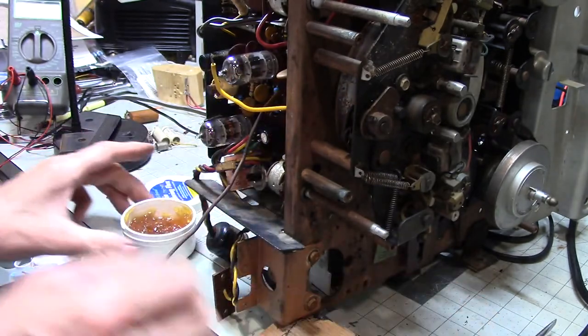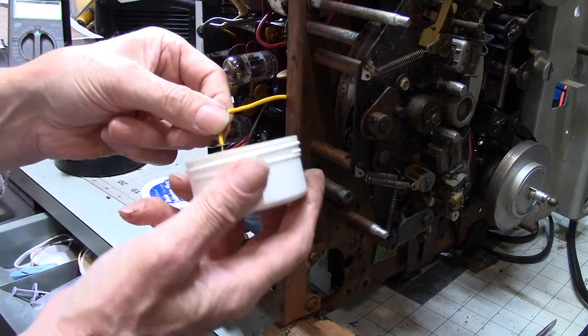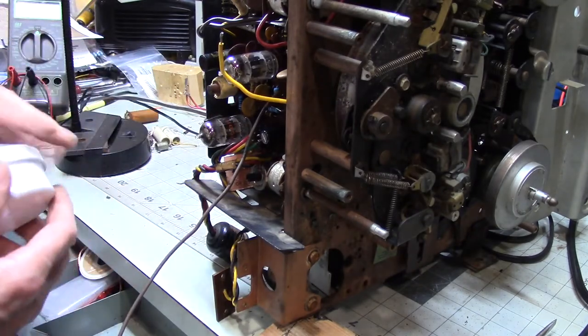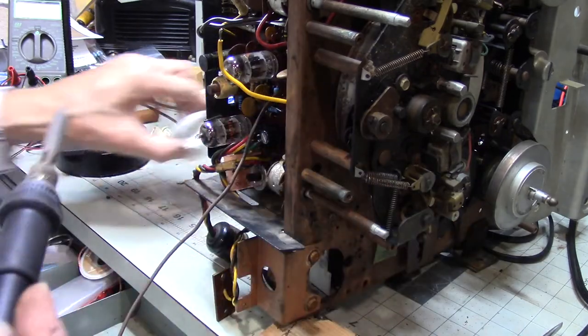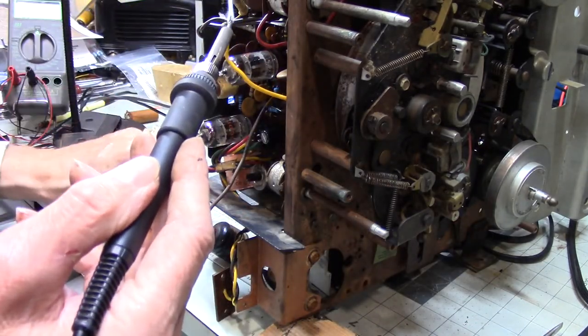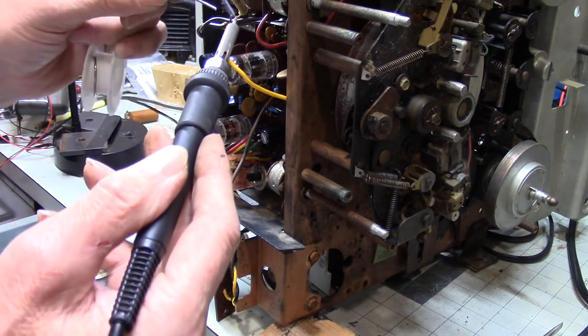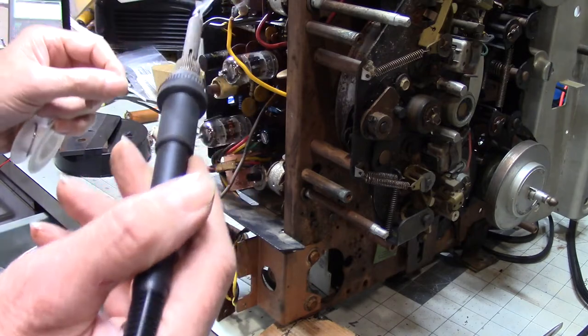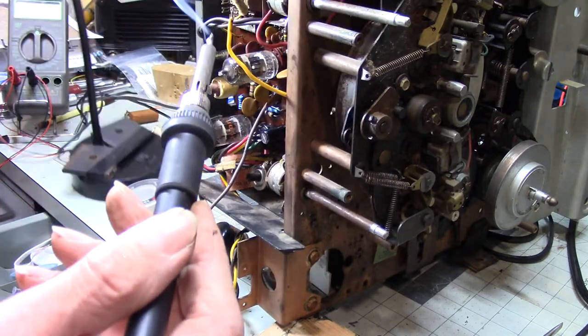So this is how I use this for solder joints that are a little difficult to get to take solder. I tin it with that. Heat it up, it smokes pretty good, but it cleans up really nice. Then I should be able to add some solder and have it actually stick. And it looks like it does. And so now,